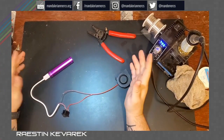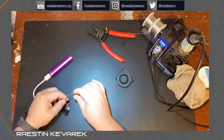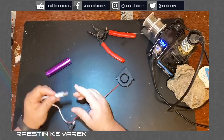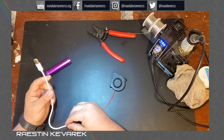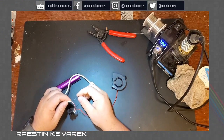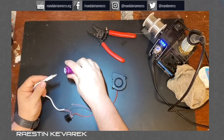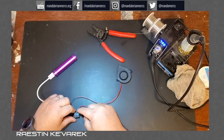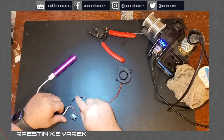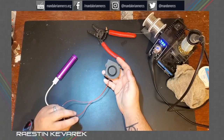We're back. I have the USB rechargeable battery hooked up and wired up the same way. You've got your ground coming from the USB cable. All we have — and we all have a ton of these cables laying around — find an old charger cable. Just cut the jacket off, strip it, and you're going to have two wires. Strip the ends off those and use it — very easy. Wired up the same way to the switch: positive coming from the battery pack going to the switch, going into the fan, and then the ground going into the fan as well. Just flip it on — there we go, it's blowing great.